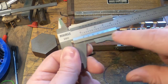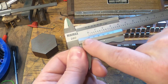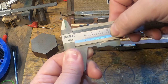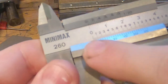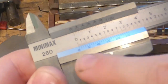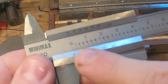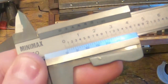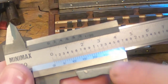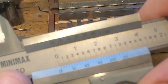If we move this 100 thousandths of an inch, the zero mark lines up the same as it did before, only we read the one. So this zero mark and this 25 mark both line up exactly on the lines. This scale divides each little division up into 25 parts, and each division is 25 parts long, so we can effectively measure one thousandth of an inch on this scale very easily.